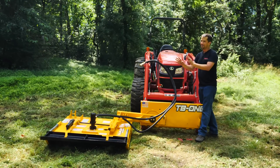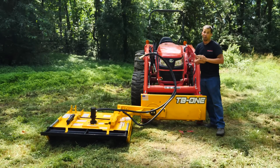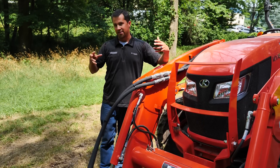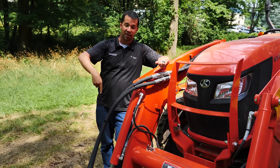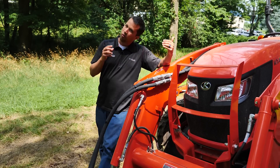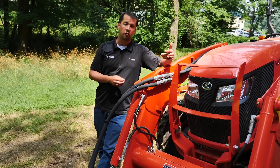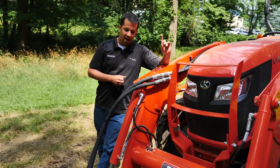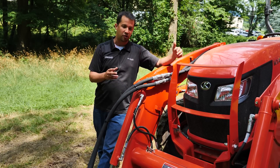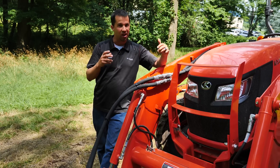With great power comes great responsibility — and this is absolutely one of those implements. You've really just got to be careful with what you're doing with it. Plumbing the hydraulics for this mower has to be done with a certain amount of care. When one of these things is running and you bring it up to speed with that big blade spinning, it needs to be able to return the oil out of that motor in all circumstances. The feed can come from any number of places — a third function, a rear remote, or the power pack on the back. But the return needs to go into a place where it can go back to sump — basically run back into the tractor or into the power pack. You cannot take both hoses and plug them straight into a rear remote or third function or you'll do damage.